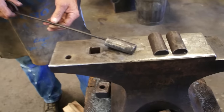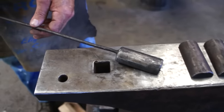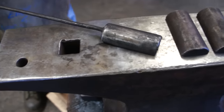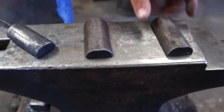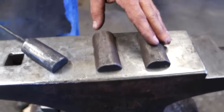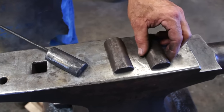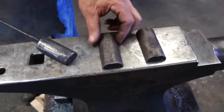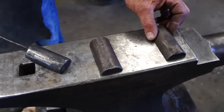This will show using the little half round. I probably use this at least every day, many times a day, mainly for straightening. It works well when it's paired with some half rounds, and it's good to have several sizes that you can use. I don't like to weld them into a fixed position — it's better to keep them kind of free floating so you can increase or decrease the distance between them if you need to straighten the piece.